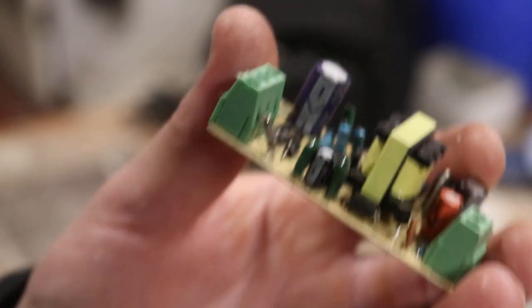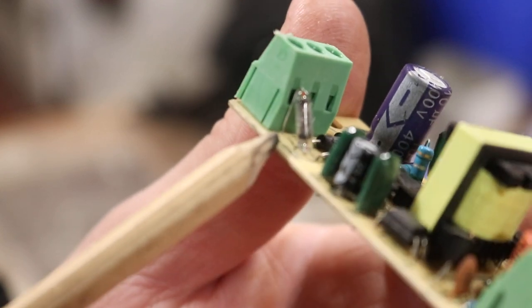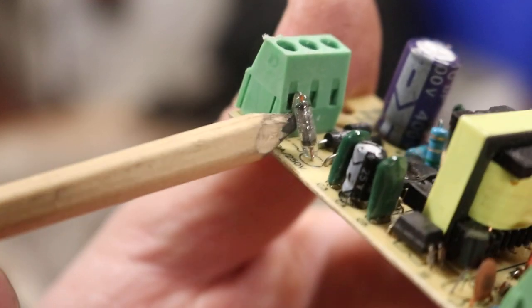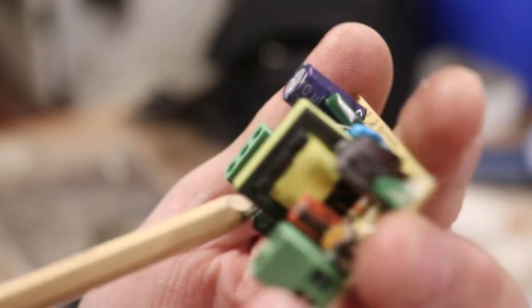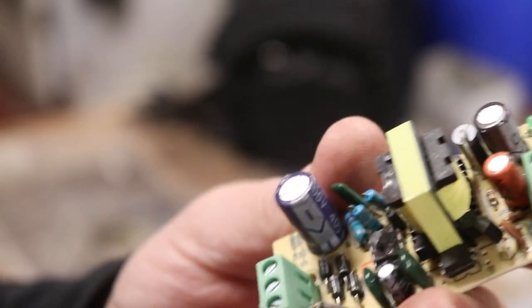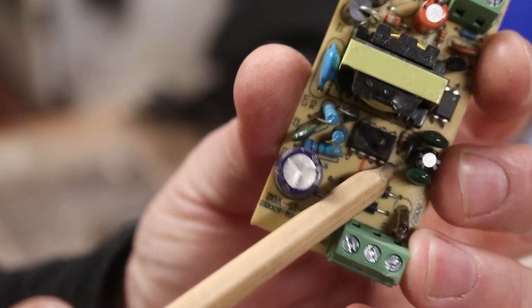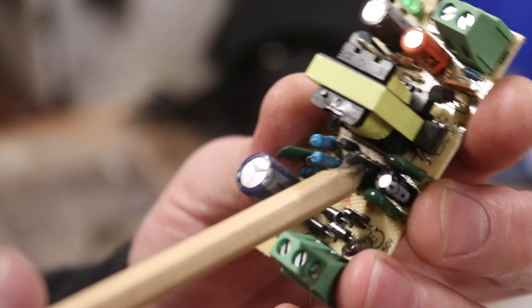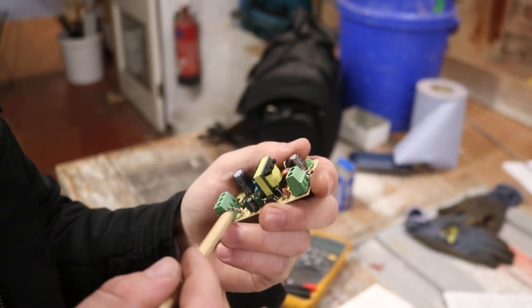And if you look at this little fella here, that is a little glass fuse, and you might be able to just see there that it has actually popped and it's all shattered inside. So obviously there was something more catastrophic, that would have been a symptom of something else that's happened, but I've just spotted it actually. And you see that chip there, it's got a hole blown out of it just there. So we've got a failed chip. I don't have any of those chips, and these are £4 off Amazon. So we're gonna go online, we're gonna buy some more of these.